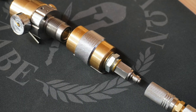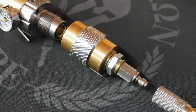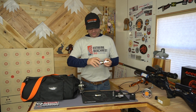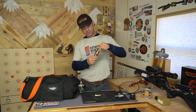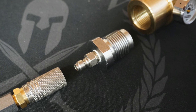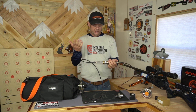So these are my adapters. I've got a DIN to — I'm not sure what size — to a 1/8 BSPP male foster fitting. And I just screw that on just like I'm screwing it into a bottle with a DIN, tighten it down. Other side, same thing — a male DIN to a male foster. Tighten that down, hook them up, and I'm ready to use it.